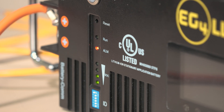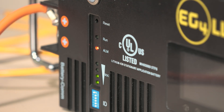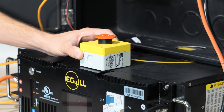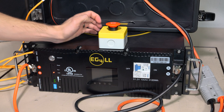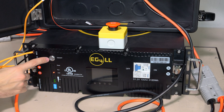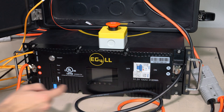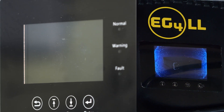This definitely doesn't take the place of an off switch, because the battery is currently in an alarm mode and simply resetting the button won't turn the breaker back on — this is definitely for emergency situations where manual resetting is necessary. To reset, first reset the emergency stop button, then power off the battery. At that point you can turn the circuit breakers back on, power the batteries back on, and the system will reboot.